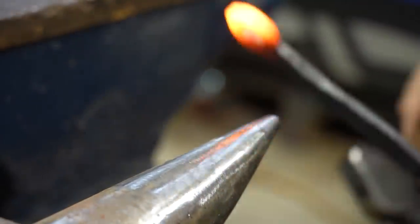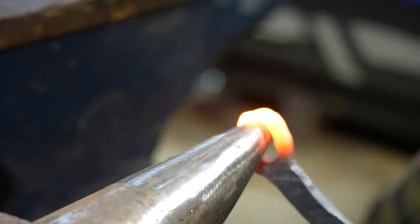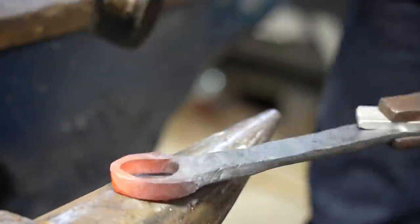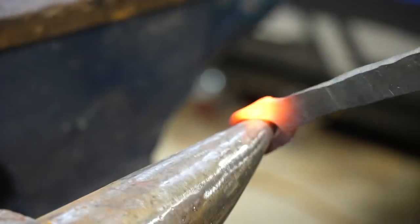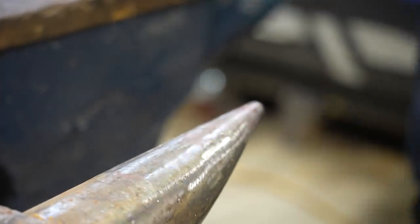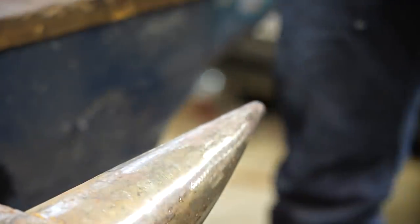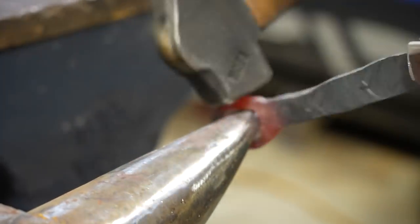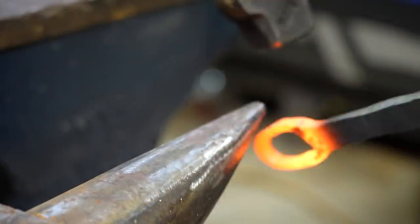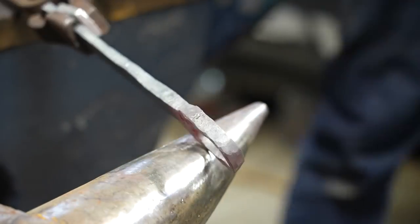I can just very gently tap that — not going super hard. I want to keep the thickness consistent as I go, using medium hammer strikes and trying to keep a reasonable shape and thickness in both directions so that I don't wind up tearing it out. My big concern is that when I'm trying to stretch out this hole, I'll make the material too thin in one area and that's going to lead to the whole thing breaking. The larger finger hole wound up with a kind of interesting shape — it's not perfectly round, but I like that it gives it a little character, and I leave that little swoop in the end of it.